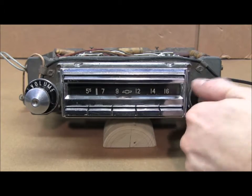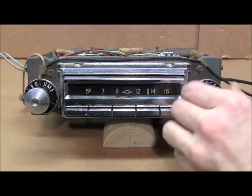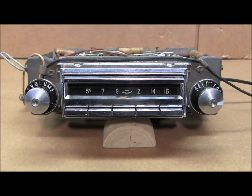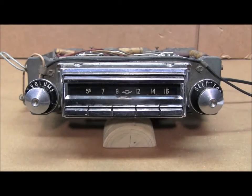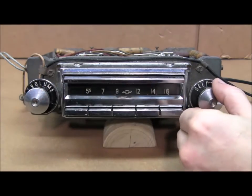As you can see, you can set the level of the output. We'll go ahead and set it pretty high on this radio. Now the FMC1 cycles back around to the first step, and at this point you can either go through the setup procedure again, or just turn the radio off since you're done with the setup procedure. Turn the radio back on, and you are now in FM mode.